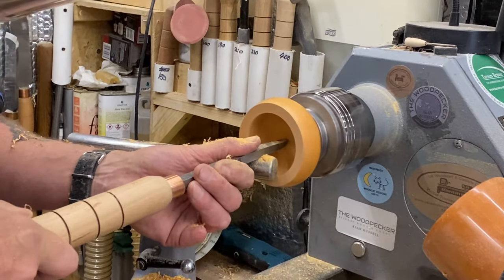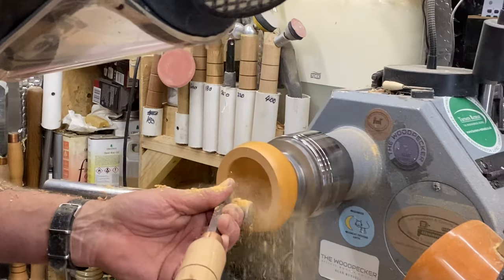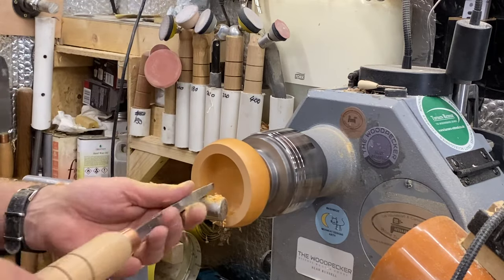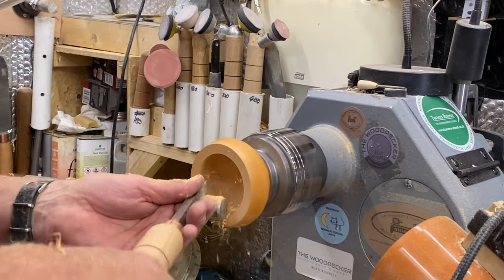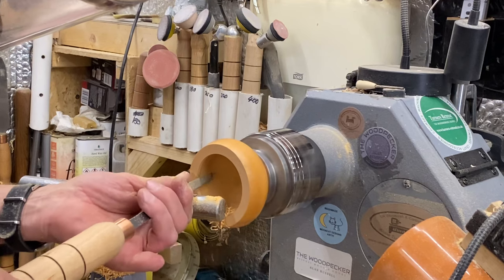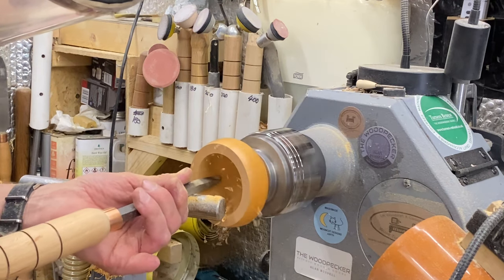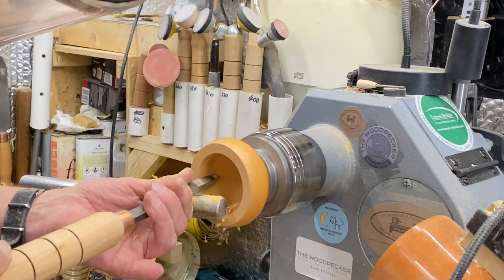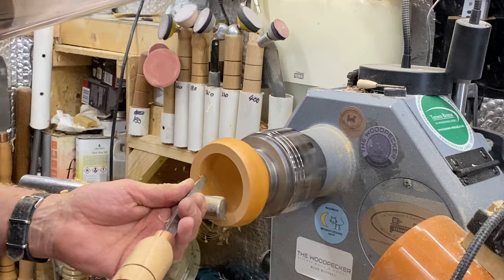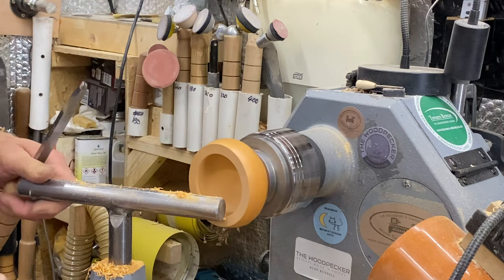Grabbing a little bit there. I'm on centre. Just grabbing that little bit as I'm coming down there, that's all. So just got rid of some of that stuff. Because I'd like a little step down there, but this is the problem, look, I'm getting all this filling up. But as I come round, I had a little step in there, so it's just catching until I got that rid of that. Now that's gone. No, it's still there a little bit, see? It just caught. Let me come round this way. Just catching where the cutter was up. That's it, it's gone now. Lovely and smooth. Right. But obviously, because I'm round there, I can't roll it and go that way. It won't allow me.